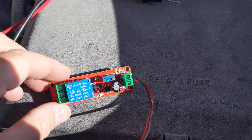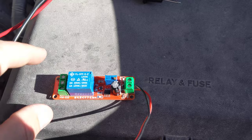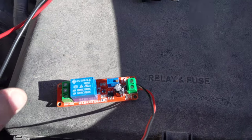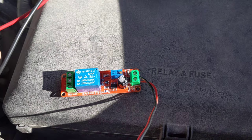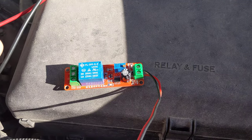You got your 12 volts in, your common and then normally closed, normally open on the relay, and then a pot where you can adjust quite a bit. It goes up to a ten second delay but it's factory set to a five second delay.